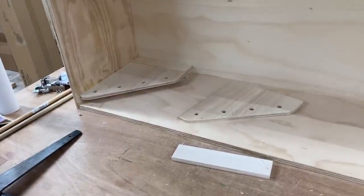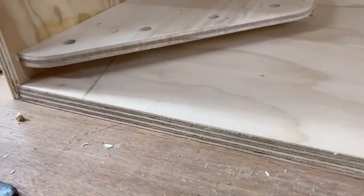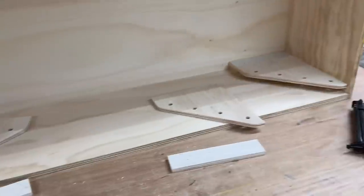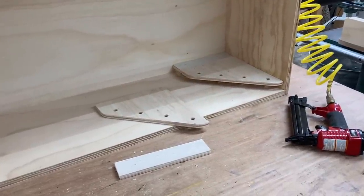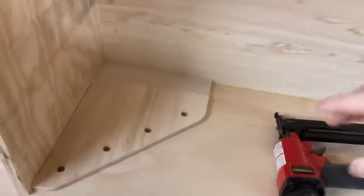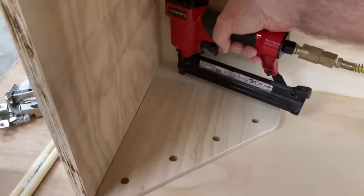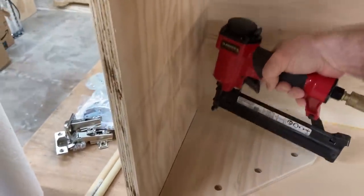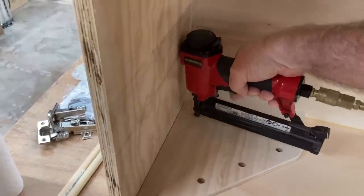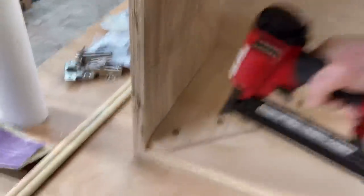This is the top of the cabinet and the bracket actually has to extend about three quarters of an inch, so there's wood underneath to provide that spacing. I also decided to pull this bracket up about two inches based on some tools I want to put on that back panel — I needed that extra space. So I just shifted the bracket forward, put a two inch spacer in, and it worked just fine.